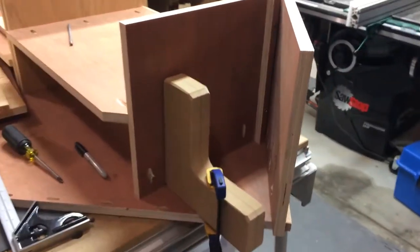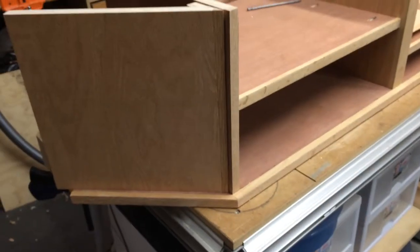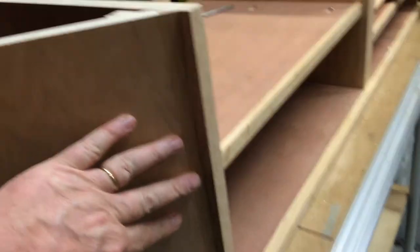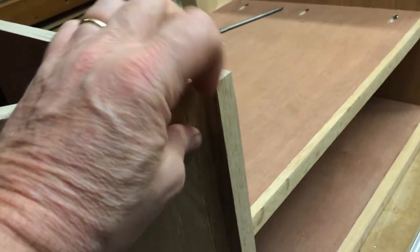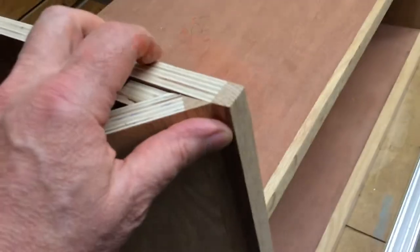Just a quick update on what I'm doing here - I'm cutting in these miters for these side pieces. Rather than trying to make this edge and that miter match up perfectly, I've decided to pull it back just a little bit with a recess so that I can close that joint up nice and evenly. I'm going to use both dominoes and pocket hole screws on that, and with pocket holes, if you don't really tie it down, it has a tendency to try to move.